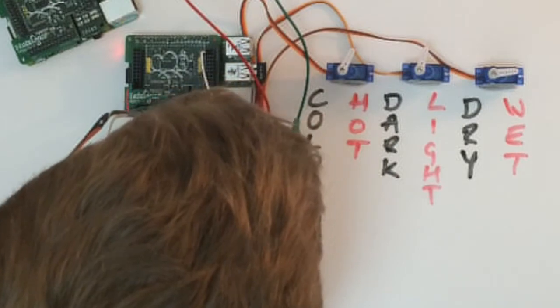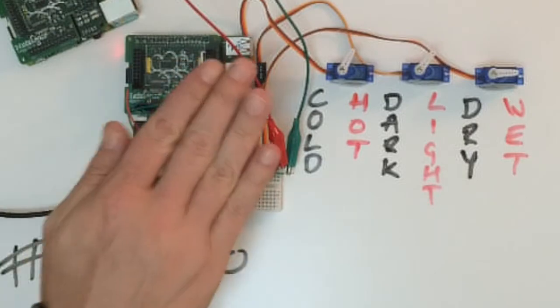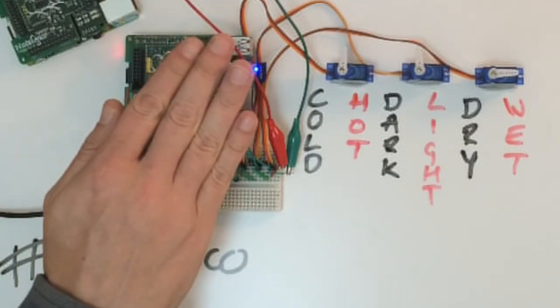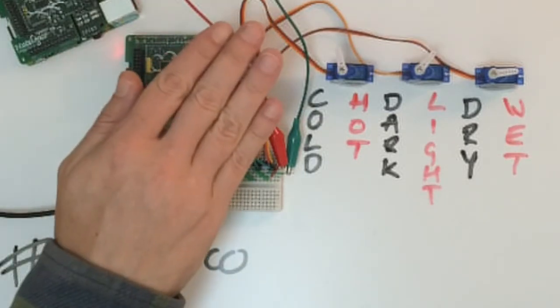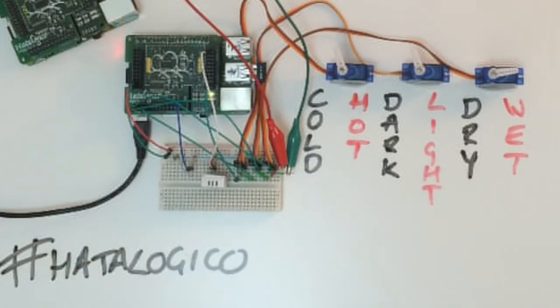I'll put the software I wrote for this up on the GitHub Gist pages, but there really isn't much to it. There is a little bit of lag sometimes, especially from the humidity and temperature sensors. Sometimes the DHT22 can take up to about 2 seconds for a reading, so after I move my hand away the servo can take a little bit to react — there it goes. So that's a simplification of a project that I saw at the Raspberry Pi Jam.